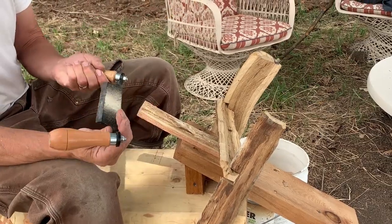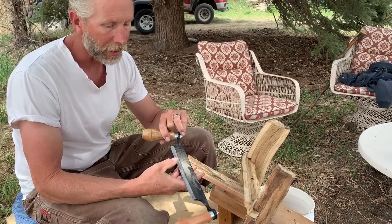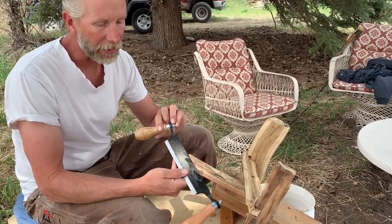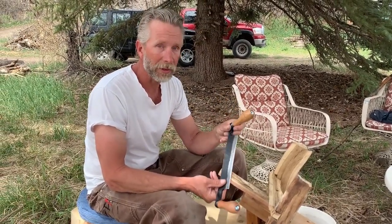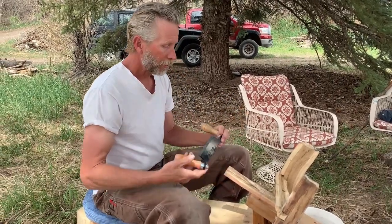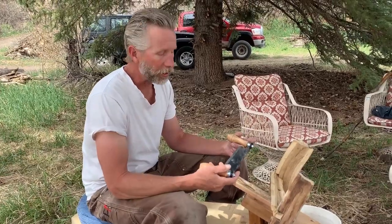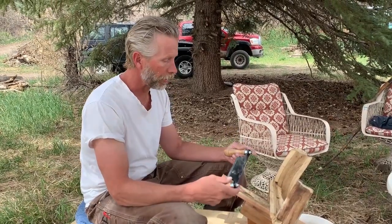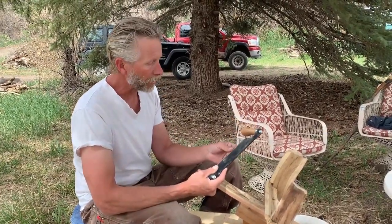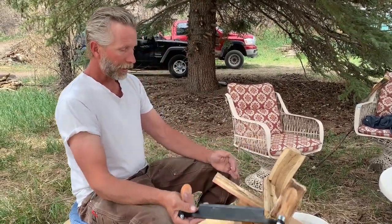This draw knife — I spent a lot of time sharpening it after I got it out of the box. It's got a pretty darn good edge on it. The sharper your edge on your draw knife, the easier this work is going to be, the less fatigue you'll have, the more enjoyable it'll be. I did 23 pegs already, then went ahead and tuned it up — just four or five strokes with a thousand-grit stone, then a six-thousand-grit stone, then honed it to a really nice edge. Good sharpening discipline will make all of your woodwork much more enjoyable.